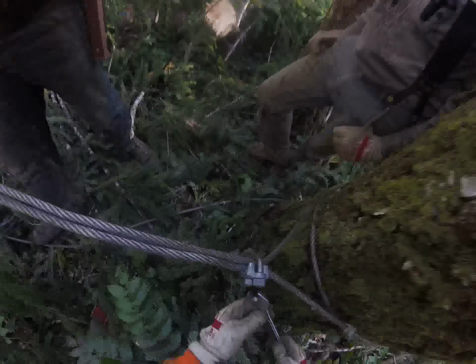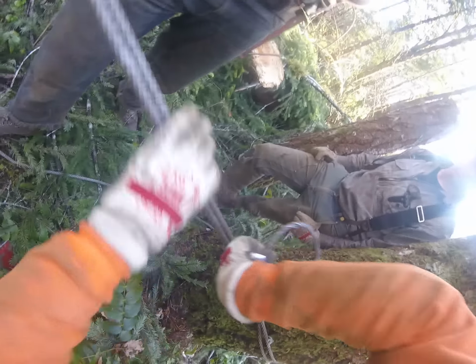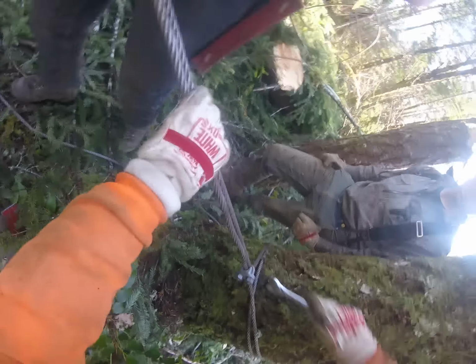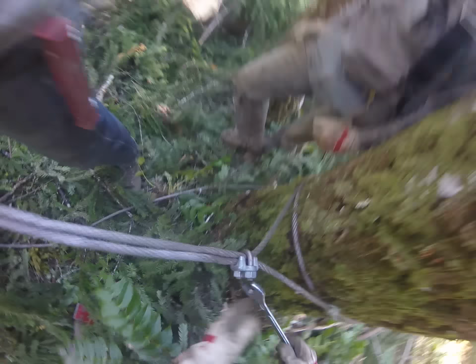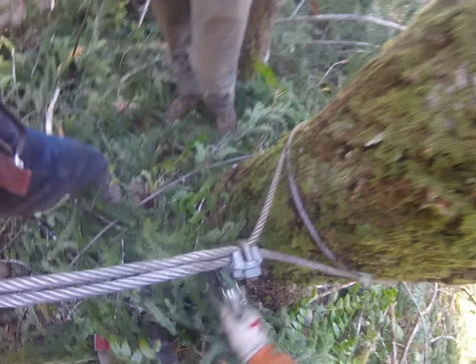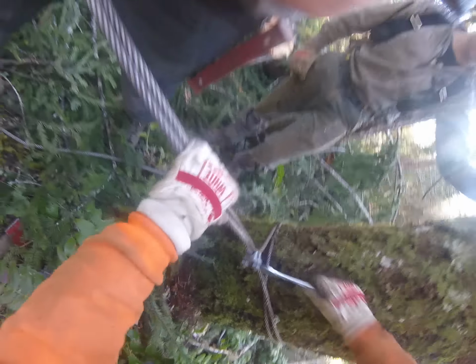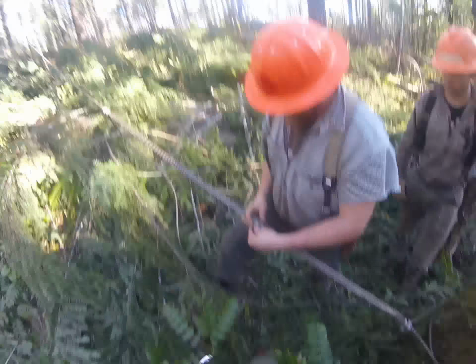I don't know, I was looking at it. Well, no, because it's still got to have some deflection. This yarder doesn't free spool the way a yarder should, so you're actually about right. I was looking at that going, my head's just near in line with the skyline. This thing does not free spool, and I don't know why, because the skid line friction is not too tight. So if you don't kick it into neutral, it does not want to run back, which sucks.